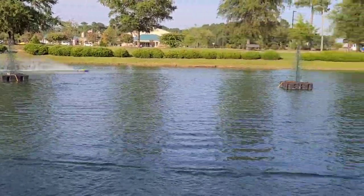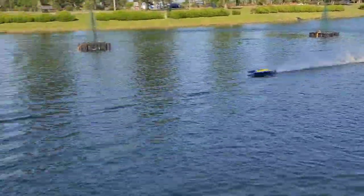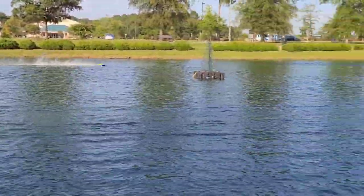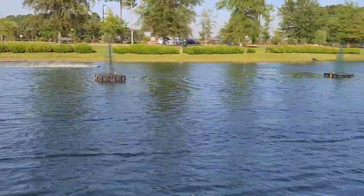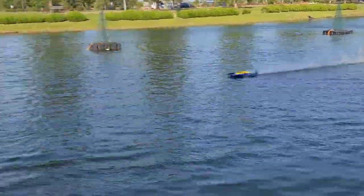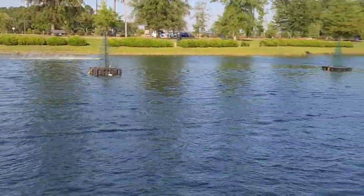Yeah, I think flattening out those sponsons a degree or so may help. You know, do a light blueprint, maybe even do some graphite or something later on with it. I was actually looking up G10 last night. It's like a laminate type sheet that you can glue on the sponsons and kind of change up the AOA with a G10 sheet. I'm also considering that.